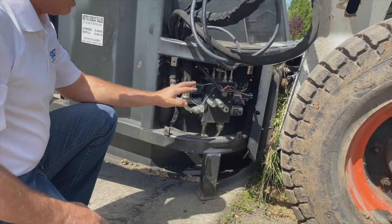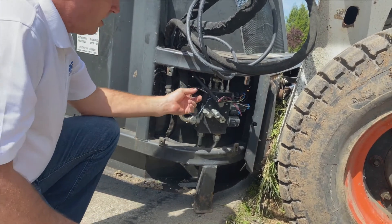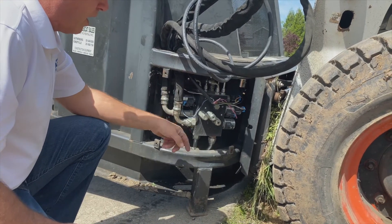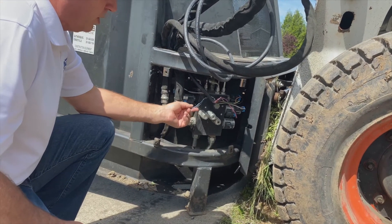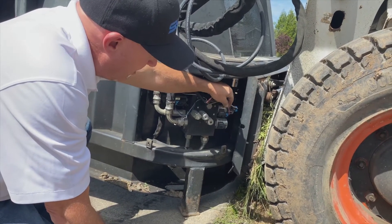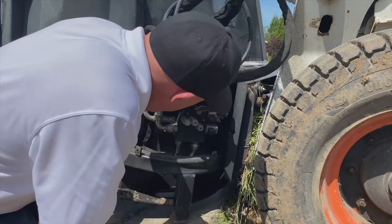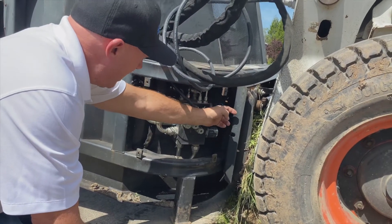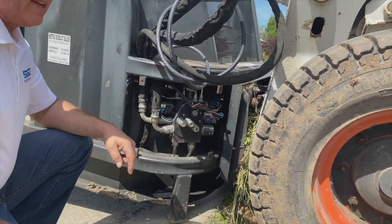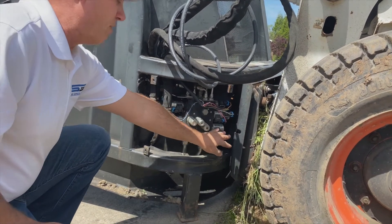Now I'm going to give you the pin-out. For most of you running standard controls: on retract, which is the top solenoid, I have my black-white wire; on the bottom one for extend, I have my blue; on up and down, my down is red and my up is white; and in the back for left and right, my left is green and my right is orange. That's on our six-channel harness. I'm not using the brake on this one — if you really want to use the brake, contact us, because we have another way of doing that.